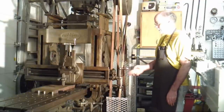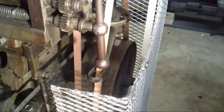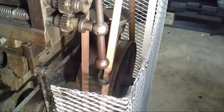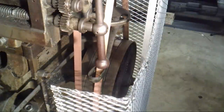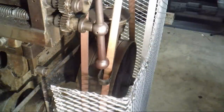I'm going to zoom in and show you a little bit about the mechanism and how it works. If the guard's in place, it's a little bit difficult to show the reversing mechanism, so I'm going to pull the guards off for a bit. When I move the lever and engage it, you can see that the belts shift over, the table moves, and then when the dog hits the control arm, the belt shifters shift the forward driving belt into play. So right now we're on the cutting stroke and the table is moving slowly. The dog gets into play, it bounces, and I get the return stroke — it just reciprocates along the way.